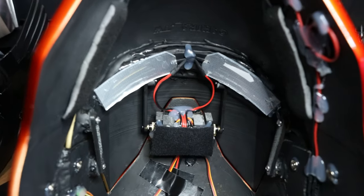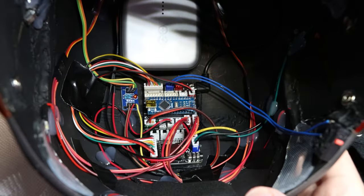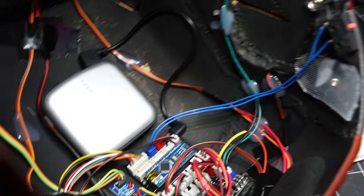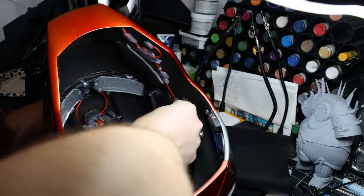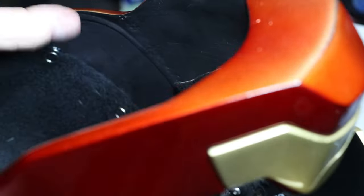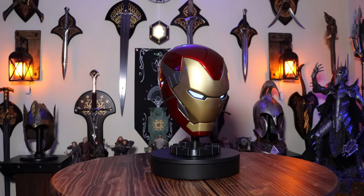After the clear coat is dry, move on to the very last step: hot gluing all the internals into their final resting place and adding some padding. I placed the battery at the top and the Arduino and other boards towards the back of the helmet so my head presses against the battery rather than a web of wires. I then bought some metal snap buttons and glued them to the inside, attached them to a cut piece of black felt fabric to cover the wires — it looks nicer on the inside and helps protect the wires.